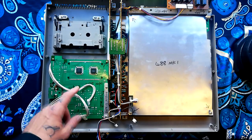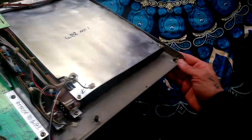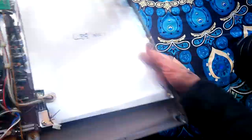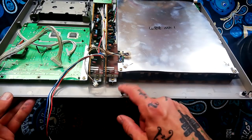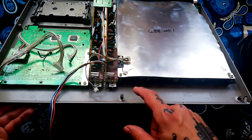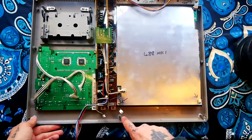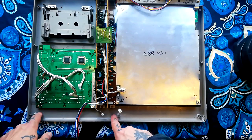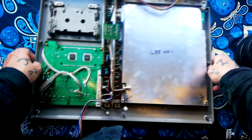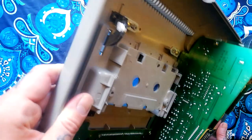Removing the caps presents you with something like this. A couple of fun things to note: there were slight cracks in this case, and when I received this unit all three of the mounting posts had come off. The replacement ones are a slightly different color of plastic — I sawed them off a Tascam Porta 1 case I wasn't using, attached them with super glue, and spin-welded around them. Spin welding is a good technique for fixing plastics; I've demonstrated it quite a bit on this channel.